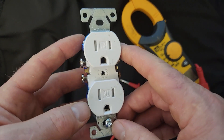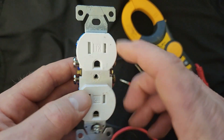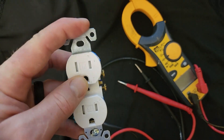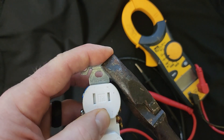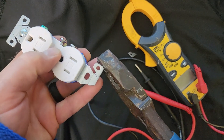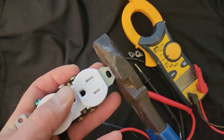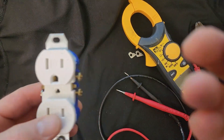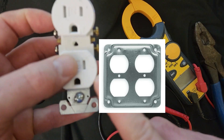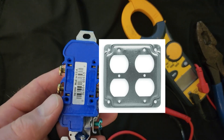Now let's talk about the yoke itself. The yoke is designed for many purposes: to hold the device to the box, and to give it mechanical strength. Here's the third tip you may not know — these ears on the yoke are actually designed to come off. You can pry them off or cut them off right here. The reason you'd remove them is shown here on screen: this is a tight faceplate cover. If you have those ears on, it will not screw to the faceplate properly — you have to take them off in order to use any type of RS cover or similar cover.